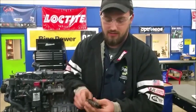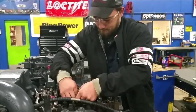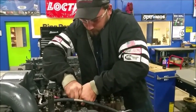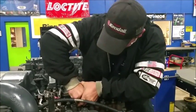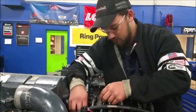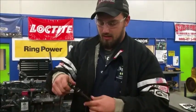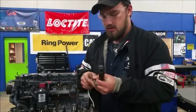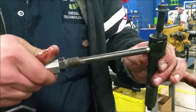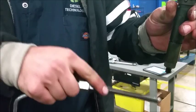You can actually take this apart and fix it if you've got a bad screen. Now, when you take these out and look at them, this part right here goes all the way through the head and connects right there to spray the fuel in. So this tightens down, it becomes a very tight squeeze — no fuel will leak out — and the fuel gets shot down into the cylinder through right here.